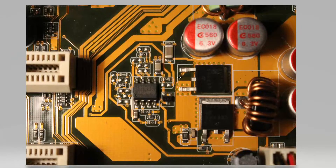So let's move on to our chipset voltage. This pin here is our feedback pin; it's also present here and here, so you have nice unpopulated pads to solder your wire to. From there the usual stuff — a resistor to ground. For value I personally use 10 kilohms, but 10 to 20 kilohms is perfectly fine here.